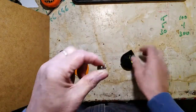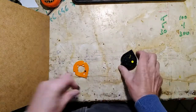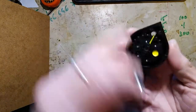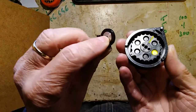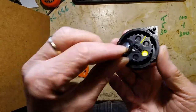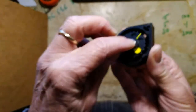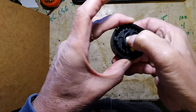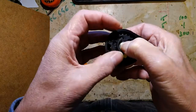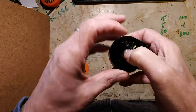To check that, what you can do is, without putting any nuts, bolts, springs, balls or anything else in there, just insert that part and that part. Don't worry about a cover for the moment. Push them into there, and then if you just hold the silver with your thumb pushing it down, the outer part should almost just spin very, very freely.